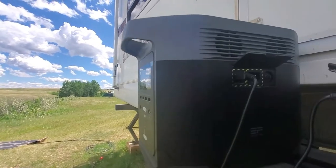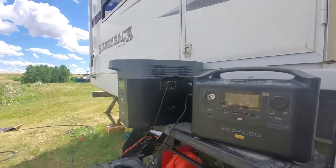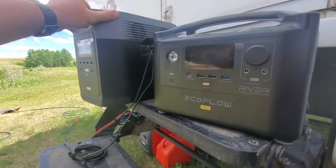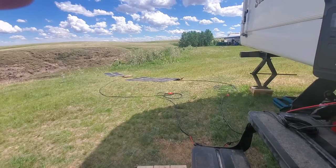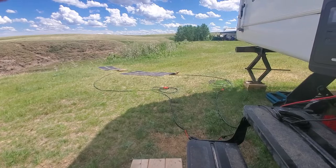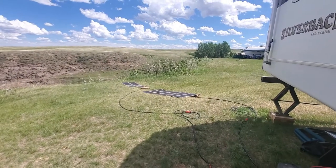So the Delta, as an example — the maximum charging from solar is 65 volts, 10 amps max. What that translates to based on what we offer: one of our 200-watt solar blankets can definitely power it because it's 10 amps max, or we can do two in series because we're not going to match the voltage on that. We can also use one of our 120-watt solar blankets.